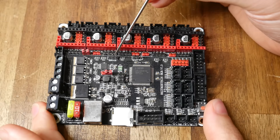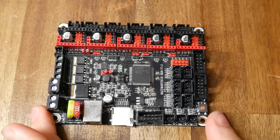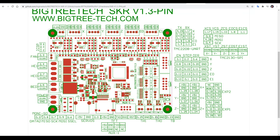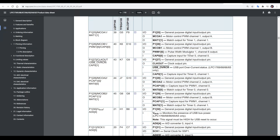What if we can't use the inbuilt servo port — how can we find out if any other spare pins are suitable? We can look elsewhere on the board for spare pins. An obvious place to look might be the max endstop pins, and we can see from the diagram we have pin 128 and 126. We can Google the chip used on the mainboard and go inside the datasheet — there'll be a section called pin description. Pin 126 supports PWM whereas pin 128 is missing that from the description, so pin 126 would be the winner for the yellow wire.